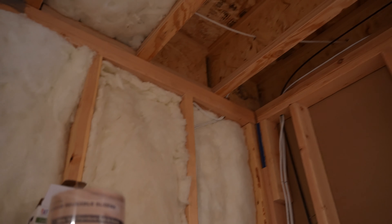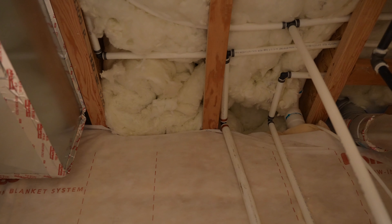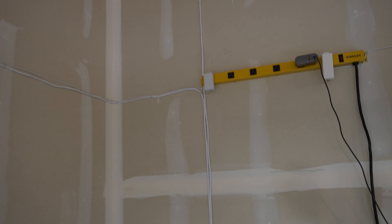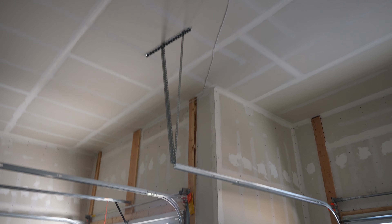The cables run up and through, going out into the garage. Here are the G4 Pro and G4 Bullet installed in front of my garage — I just ran these two Cat6 cables out. Probably the easiest install for me was the garage cameras because I literally just ran these cables along the inside of my garage. Here's the G4 Bullet on the side, going diagonally over to the side of the garage, with the termination point coming down there.